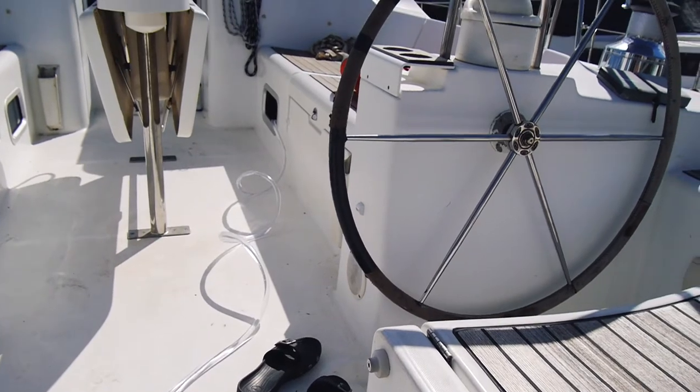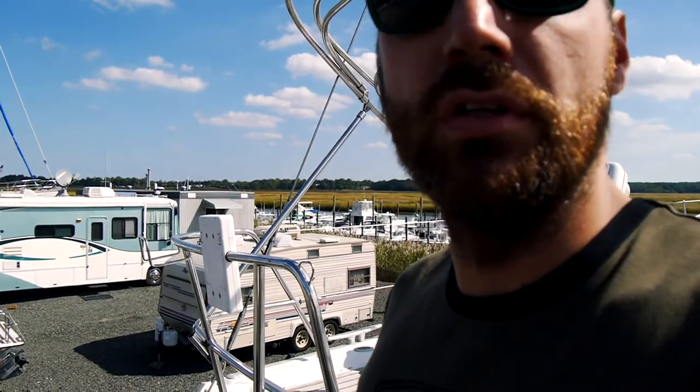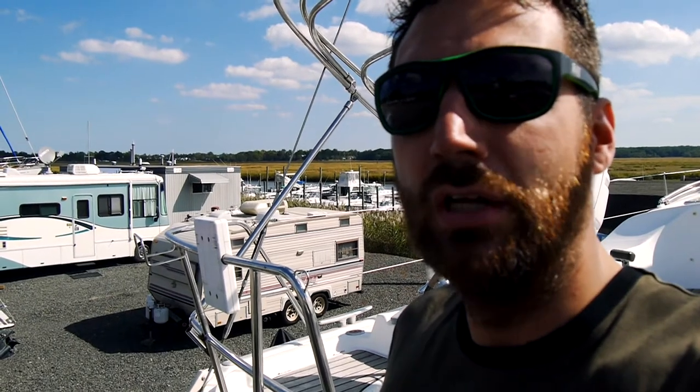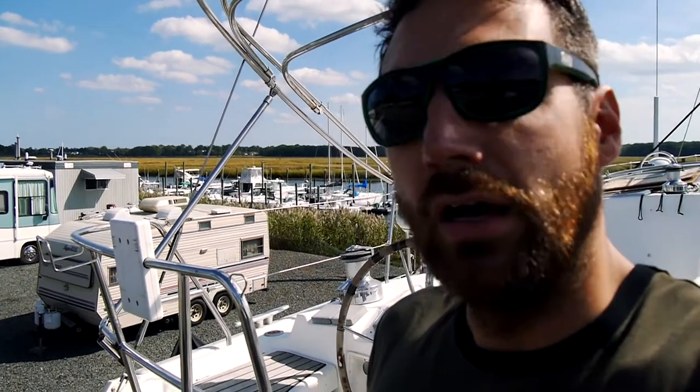And what we will do later on is we will put antifreeze in this little bucket and then it will just flush through the seawater intake from the generator as well as the engine, because we have the same sea strainer, we can just quickly change the flush cap and then we're good. So now we have this little nice thing and it's a very easy system actually, without a lot of effort. Awesome!